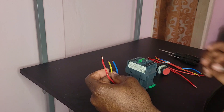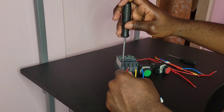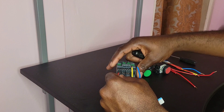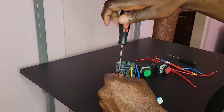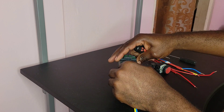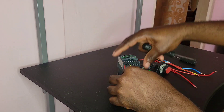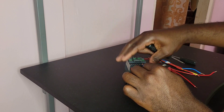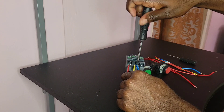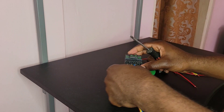The first thing we're gonna do is connect our load, which is our three phase motor. We're just gonna go ahead and connect our three phase to T1, T2 and T3. This is where we will connect our load with our three phase red, yellow and blue — connect the red, then the yellow, and blue to T3. It doesn't necessarily have to be in that sequence where red goes to T1, yellow to T2, and blue to T3.